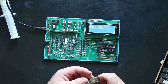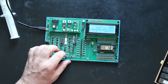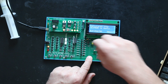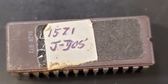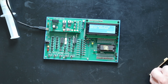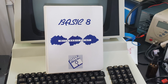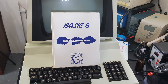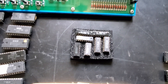For the program ROMs, all I could do was test them by checking the CRC code and making sure it was the same every time — if it's continually changing, the EEPROM is bad; if it's consistent, there's a good chance it's good. Once I get another 128 restored I'll play with some of these, since there is a socket in the 128 just for adding program ROMs. I also found several JiffyDOS EEPROMs for the Commodore 128, the 1571, and a 1581 kernel EEPROM, plus a couple of Basic 8 PROMs. Basic 8 was an upgrade to the Commodore 128's Basic 7 with added graphics commands.